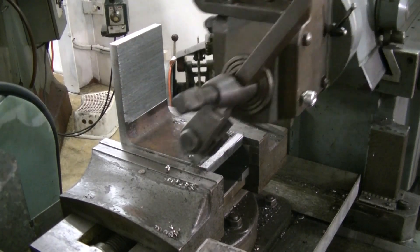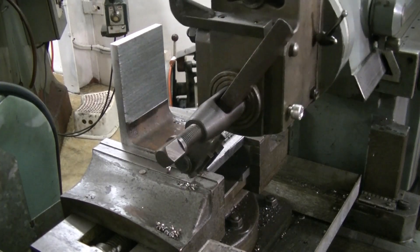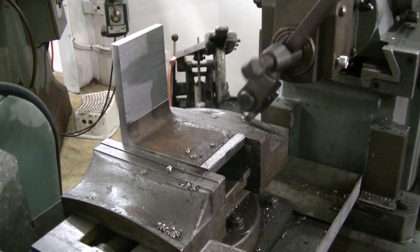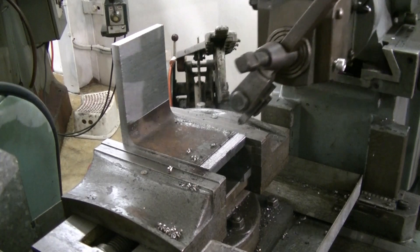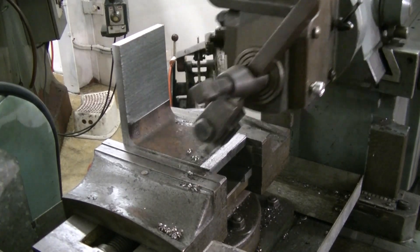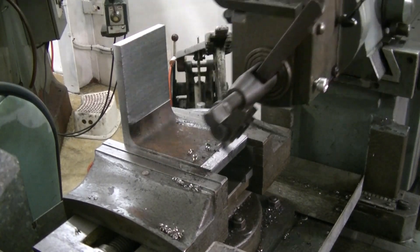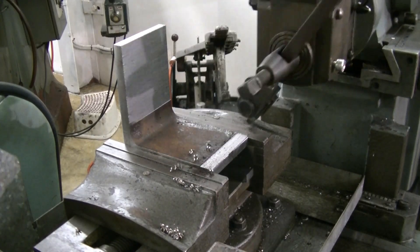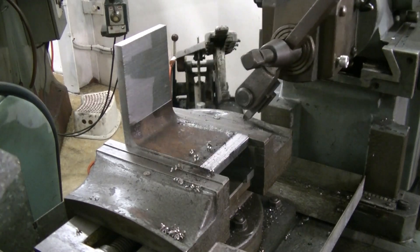It's a very surprising piece of angle iron. This side is reasonably flat and even, but the other side I had to take two millimetres off it to get a flat plate. I'd hoped to be putting this to good use but it is just an uneven piece of rubbish material. You've also got to be very careful when it gets to the far side, as you can't get right into the corner before the tool holder hits the job.